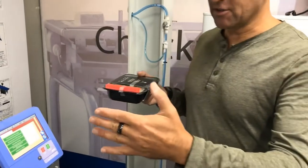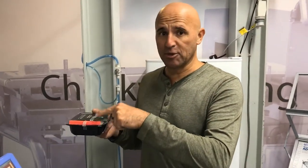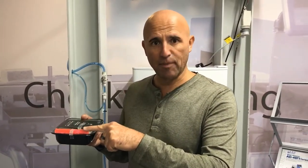If you've got quite a long product — say 300 millimeters or 400 millimeters long — the time difference between when it detects it if the contaminant is at the beginning of the pack compared to the end could be as much as half a second to a second. So that will totally mess with your output times for the subsequent device.